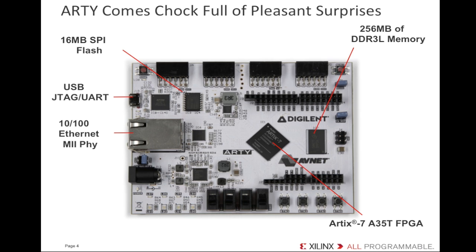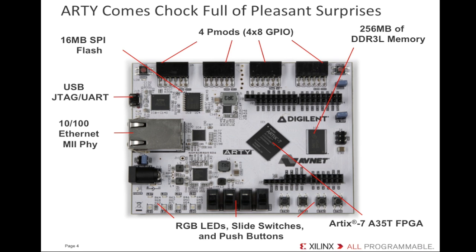In addition, it has four monochromatic LEDs, four RGB LEDs, four slide switches, and four push buttons. Artie has lots of user I/O — 81, in fact. There are four Digilent PMOD ports, which give you 32 digital I/O. There's also an Arduino Shield I/O interface, which allows you to attach any number of Arduino Shields. Using the FPGA fabric and the Arduino Shield and PMOD ports, you can add all kinds of extra peripherals to your embedded project. Artie is packed with the typical and expected interfaces like DDR, Ethernet, and UARTs — tell me more about the Arduino Shield and the Digilent PMOD ports.